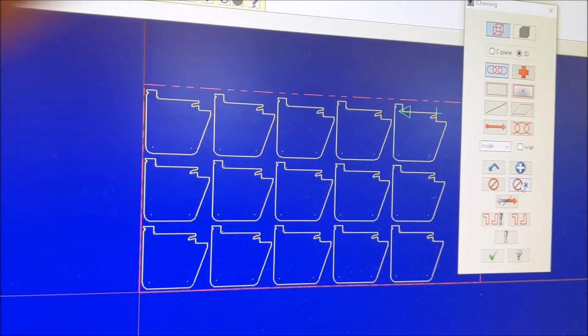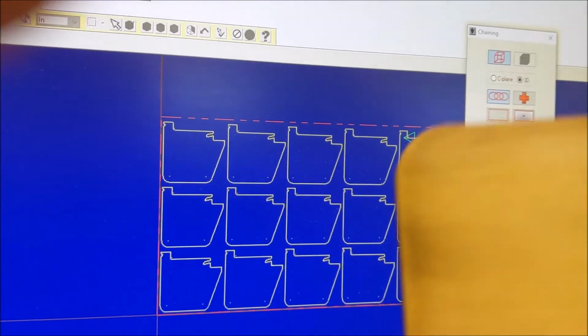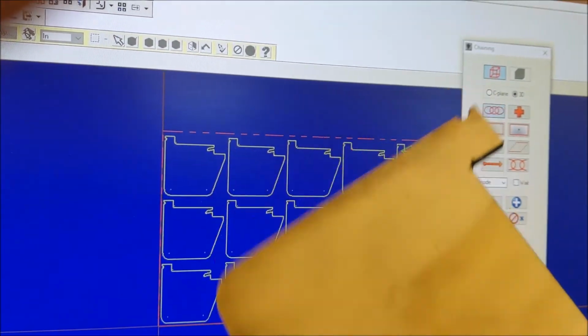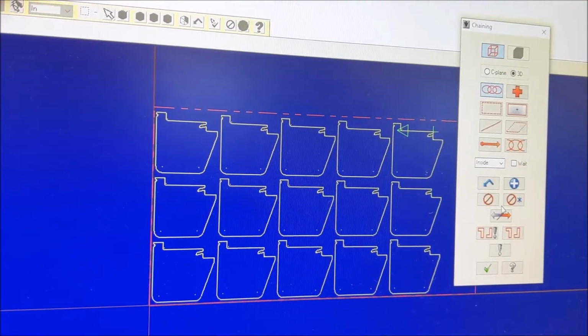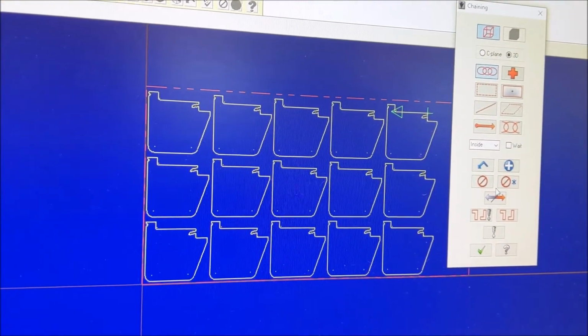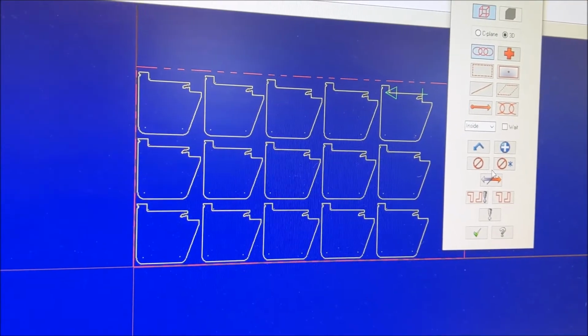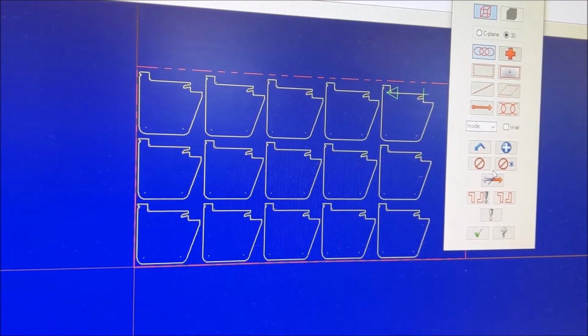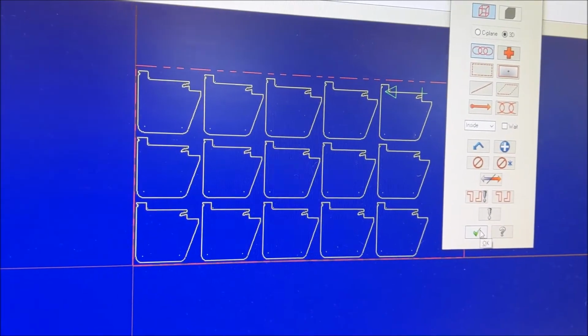Alright, now that I've got my materials and my test run, the first step was to build a wood prototype and make sure that's going to fit. Once that worked, we ran a few on the CNC, probably, I don't know, 5 or so, and got them just right, depth of cuts right, feed rate so we don't burn or chip. Now I'm just running a program to run multiple ones, like 15 per sheet, with all the feed rates that I had set before.